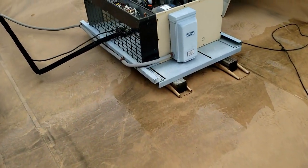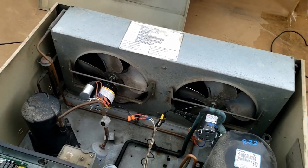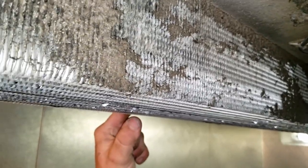This thing is R22. She did pump down, so I'm going to go downstairs and get the cover off the evaporator. You can see we got it down and it's definitely got some air restriction - there and there - so we're not getting the best airflow through it. This side here is a little better but still not great. We're going to sweep this off and get a good majority of it.